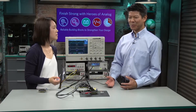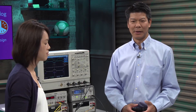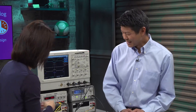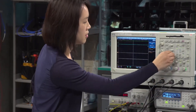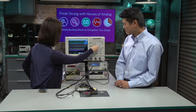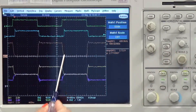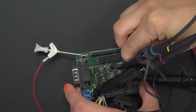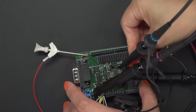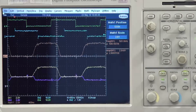The next demo will be showing slow slew rate. Slow slew rate comes in handy for applications that are operating at lower data rates but are sensitive to EMI or reflections on the line. We're going to go back to the 500-kilohertz setting. As you can see, the edges here are quite sharp — the rise and fall times are pretty sharp. Once I switch the standby pin over to the 26.1-kilohm setting, there's been a dramatic increase in the rise time and fall time, which lowers the EMI generated by the CAN transceiver.